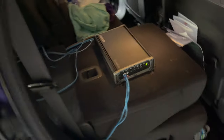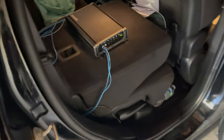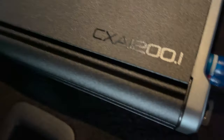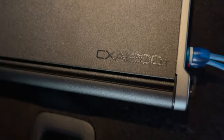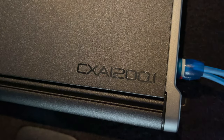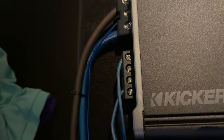For the next step you need a zero-decibel test tone — I'll try to drop a link in the description so you can download one. You also need to look into a power chart. Basically the equation is: you want to know how many watts you want at a certain ohm. This amp is rated to do 1200 watts at two ohms, so you take 1200 times two, find the square root of that, and that's the voltage you want to receive with a multimeter after you run the test tone.